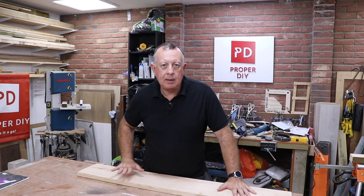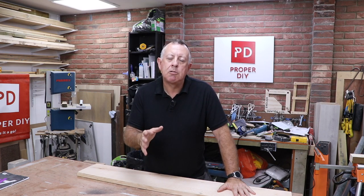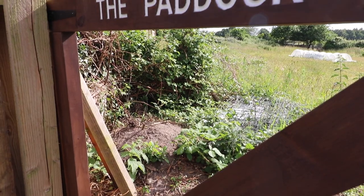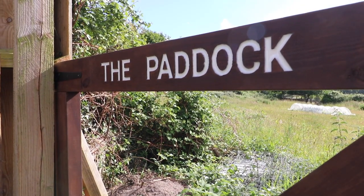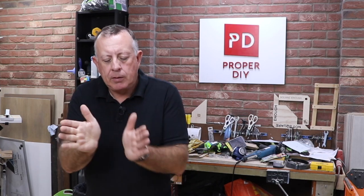Today I'm going to be cutting in oak, but you can use softwood. I've made many signs in softwood. The advantage of using hardwood though is the grain is tighter and the wood is harder, which means when you're carving into it with a router or chisel, it's easier to get a well-defined edge and corners. The problem with softwood is that because the grain is so wide, corners lose their strength and can pop out when you're working on them. So it's not impossible to carve in softwood, but I'd always recommend something like oak if you're doing a sign for your house.